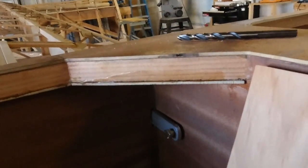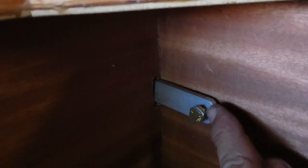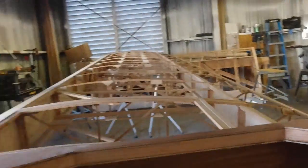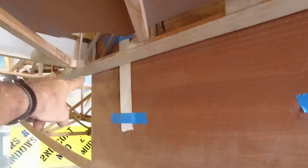The next step on the back one is once we take the wing back off, this actually gets drilled out for 3/8, and there's a bushing that goes in there that gets epoxied in place where the bolt goes through. So that gets adjusted there. And everything, even though it was challenging, worked out. Everything is level. We got 3 degrees. We ended up 3/16 above the line that we originally made with our pattern. So we made sure we were also 3/16 above our line back here, because we set those two lines earlier.